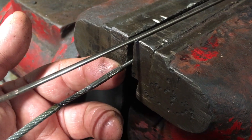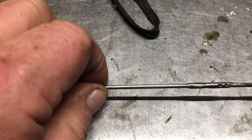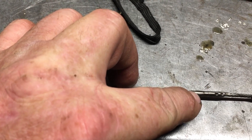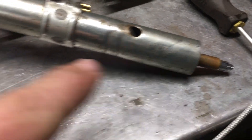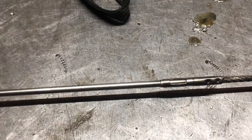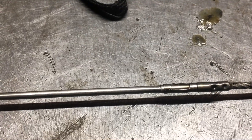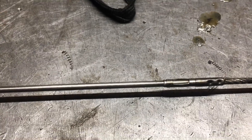Right here is where that thread starts. Just FYI — the whole reason for the antenna is this little brush that always has to come into contact with tube sections two and three. If you call the main section part one, the mast would be the second stage and the outer the third. The brush is the conductor. If you damage that brush, you lose continuity between stages.